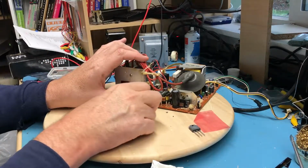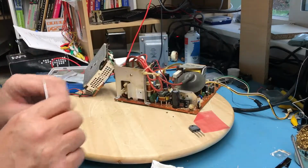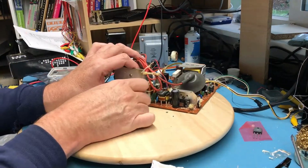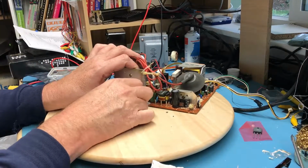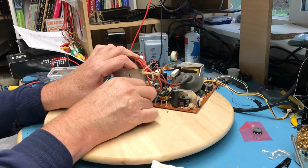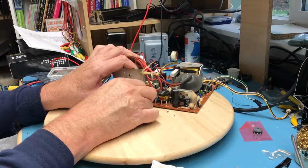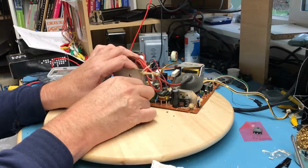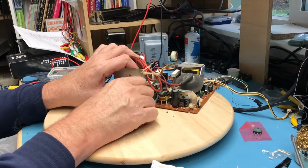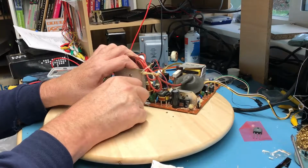I know that's not all of the washer. The mica is peeling apart. There we go. It's just a very old, very brittle, very dead mica washer. Let me set this out of the way so I don't lose it. We'll see if we can scrape some of this out of here. It's pretty gummy. Might have to use a little bit of solvent on it. And looking at this device, it may have been replaced once before. It's hard to say, just based on the smear I see here.